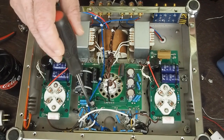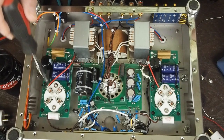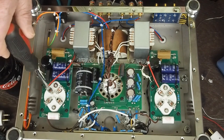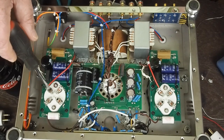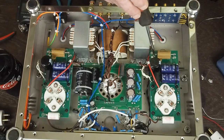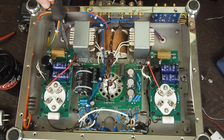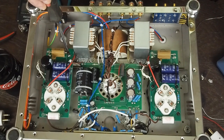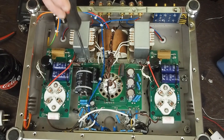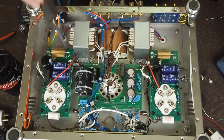And we'll cover the wiring and stuff and how all this front end is done. Here's where you measure the voltage at the plate. I'm measuring the cathode voltage right here and here. And this I use for my ground terminal for my voltmeter, because it's connected to this ground. There's this ground that's kind of a good common ground point that's easy to get to.